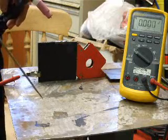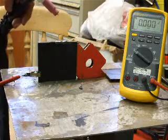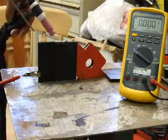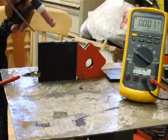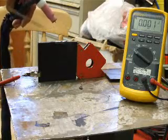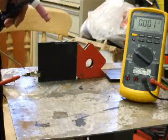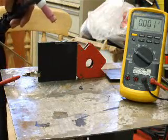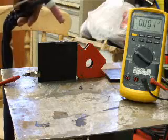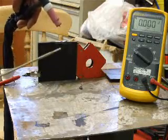So what I am going to do is start the machine up running at about 90 amps. I am going to run an autogenous weld pass along the top middle section of this plate. This plate measures 1cm x 10cm x 9cm deep. I am going to run that in for around about 10 seconds, and I will get the exact time from the video. Hopefully from the video we can also pick up the voltage of the arc between the tungsten electrode and the workpiece so I can measure the power going into the work.